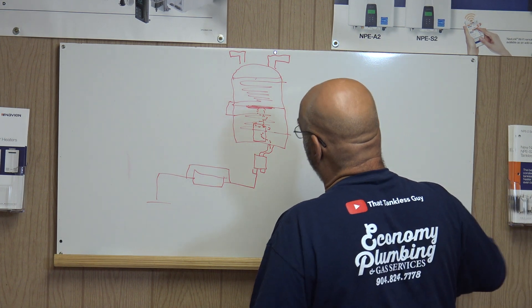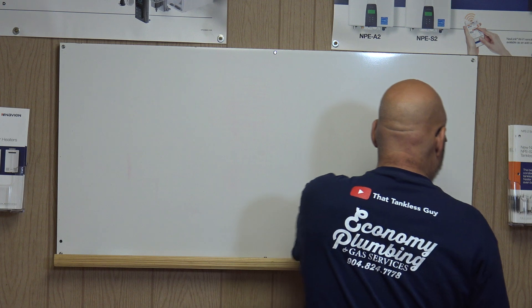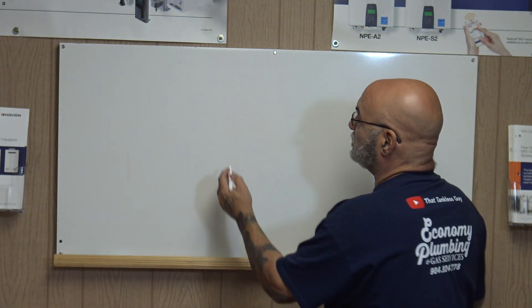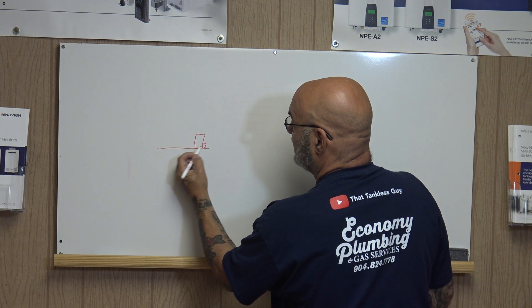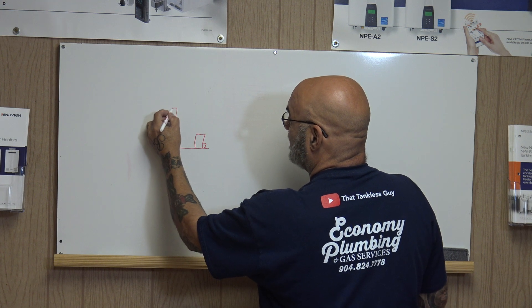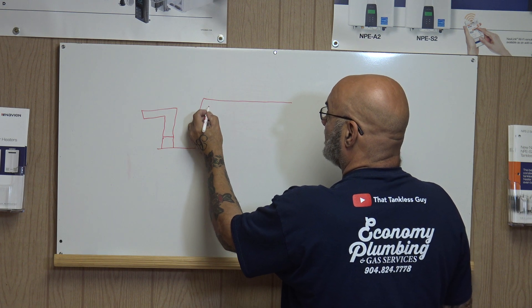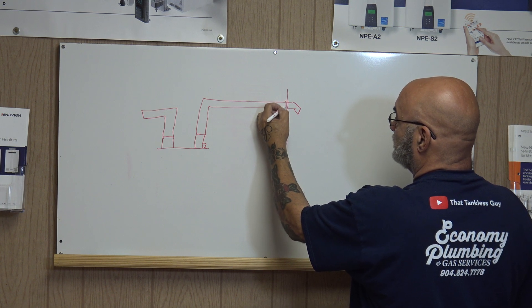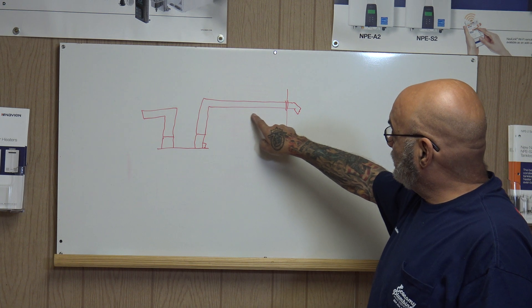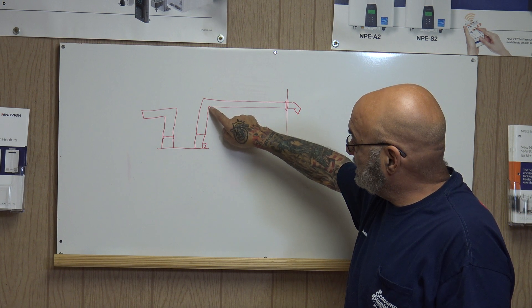So let's go into this, because there's one more part of condensation. You're allowed 65 feet of pipe, minus elbows and 45s. Let's draw the top of the unit — you have your vent safety switch, then your fresh air. Your vent normally goes like this, out the wall, 45, screen, escutcheons. Now you want this to be pitched slightly so the condensate drains out here, and the condensate on the other side drains back down.